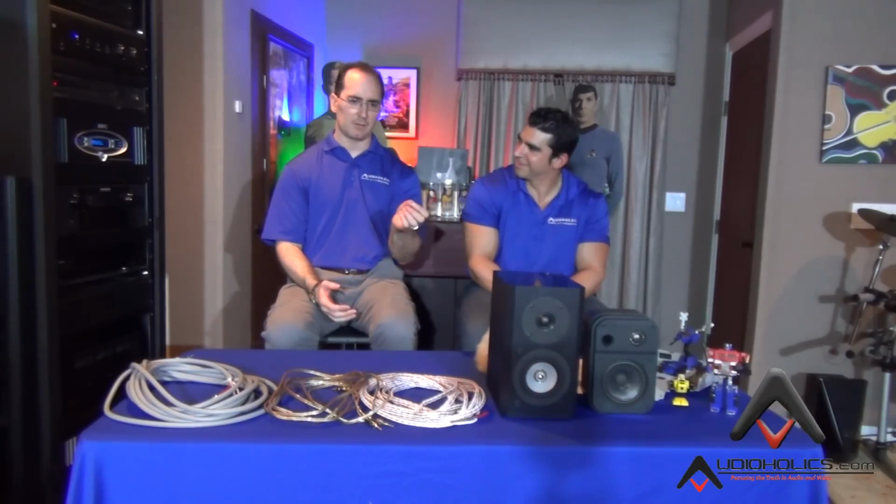So what I did was I jerry-rigged it. I rigged the preamp outs from the surround channels into the preamp ins on the front. I calculated the gain to level match for unity gain between the channels. And all of a sudden I had biamp capability on my front channels. And man, I was happy.